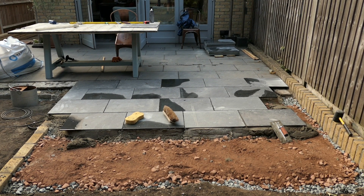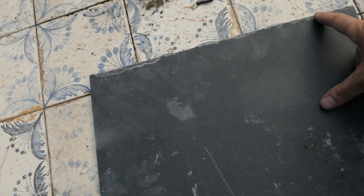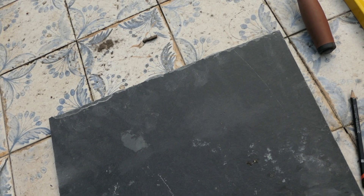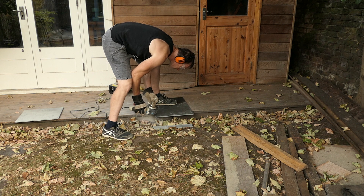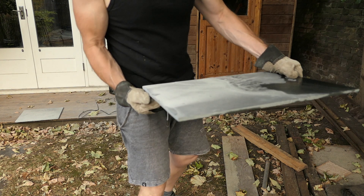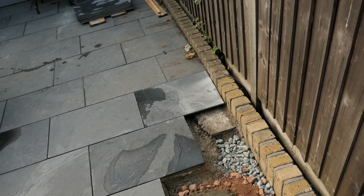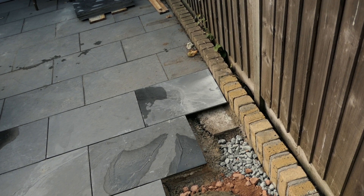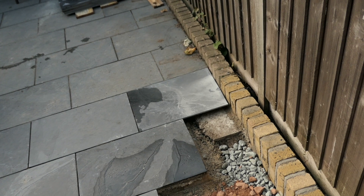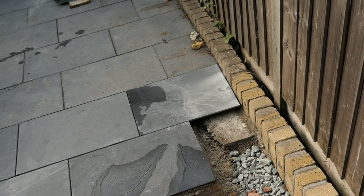Where I cut the first few tiles I turned them over, as recommended when I was searching online how to cut slate tiles. However you can see it has splintered the edges. It looks nice and rustic but I want a nice straight flat edge. This method would work well for roof tiles, however for floor tiles I want a flat edge so I'm not going to turn the tile over to cut it. That works really well — it's a bit dusty but you can see it's nice and straight with no splintering. Sometimes it's not really good to get advice on the internet and it's worth trying out for yourself. They call it experiential learning — basically learning by experience.